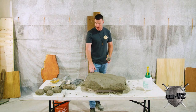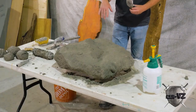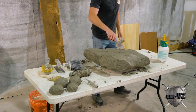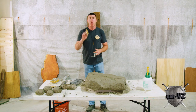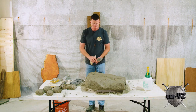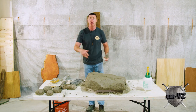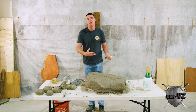Okay guys, we let this thing bake for a little over an hour. It's ready for an initial pass — that's just going to knock off some of the burrs or trowel marks left behind. Since this is going to have a more eroded finish, I'm going to make a second pass and kind of needle it out, so this will be two phases. Quick note: we're not going to be brushing off any crumbs. On a horizontal plane, what you don't want to do is start brushing your details away. We're going to use compressed air for that. Same technique applies if you're doing carved stairs — if you've got details on your tread, which is the horizontal piece, brushing will lose a lot of your detail. Compressed air is preferred.